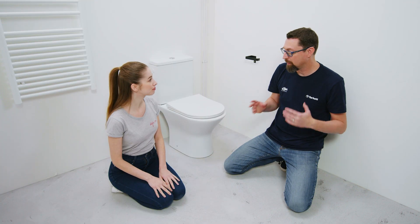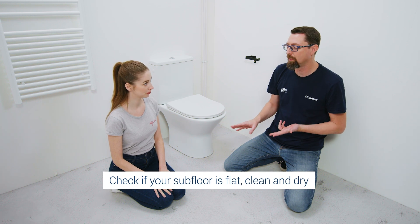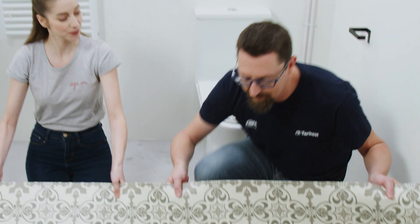So here in the bathroom, as I already explained to you during the last tutorial, we have to check that the subfloor is flat, clean and dry, and I'm pretty sure that you did it already. We have measured the room, we cut the sheet to the correct size. Now we will just unroll it and place the sheet.